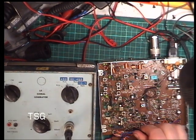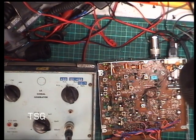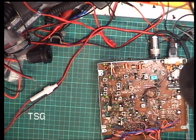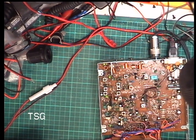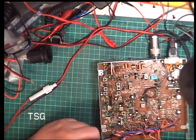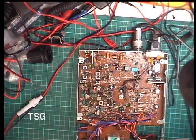So if you remember, we couldn't quite get 10.24. It was something like 10.2395. Yeah, it's just a tiny bit out, and all that means is that the IF, intermediate frequency, could be slightly lopsided. I couldn't say that, could I? Then I said wopsided, as if I can't say my R's. So there we have it. That should be fine. But it's a faff, isn't it? You know, you've got the 10.24, you've got the transmit one, you've got the receive one.